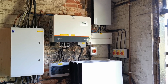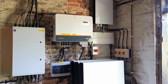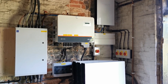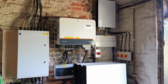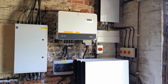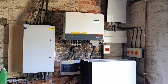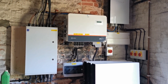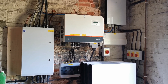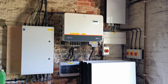I've come round now into our plant room — an old outbuilding on the back of the farm where we were able to put all this equipment. If you're contemplating solar PV, what you may not actually realise until it starts going in is all the boxes and various bits of equipment you're going to need to get this working. In the centre there is our Solis inverter — that's what's taking the DC current from those three parallel rows of panels and converting it into AC power.